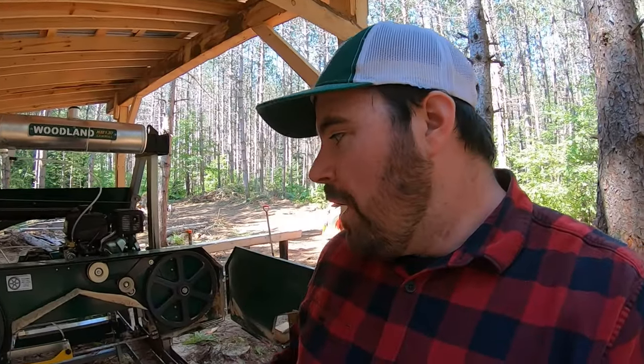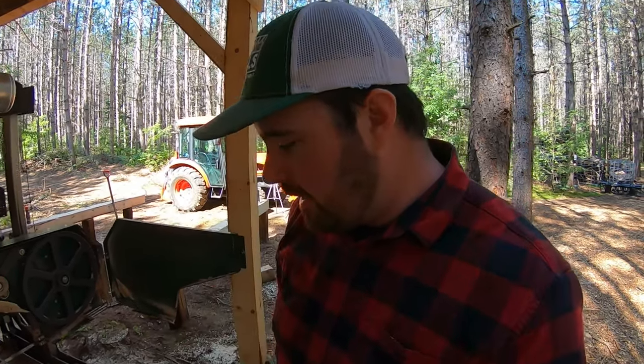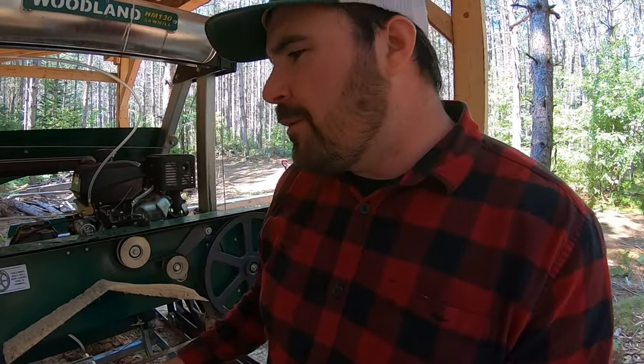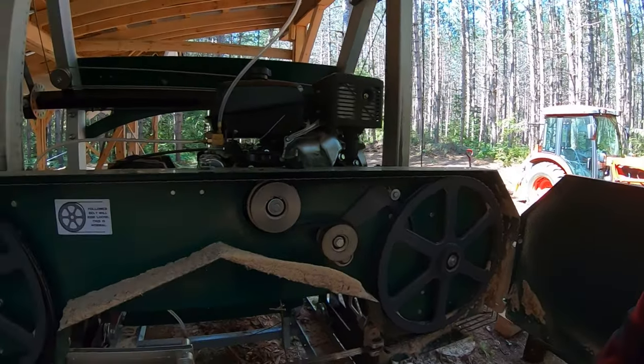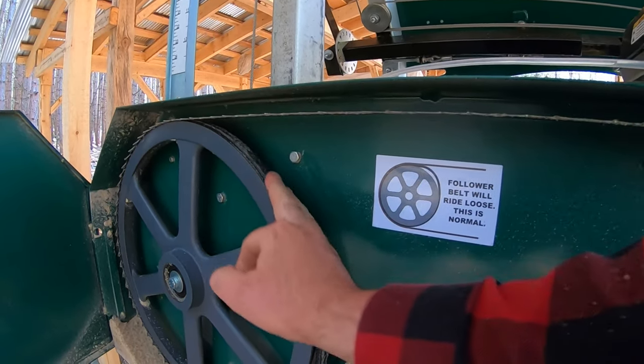Close is probably good enough as long as it's not touching — you're probably going to be good assuming the gap isn't too big either. If you get too big a gap, the one time the blade deflects a little bit and needs that guide to keep it where it should be, if the guide is too far away and the blade can't touch it, that could be another thing that kicks the blade off. Let's assume everything looks good: blade is relatively new, gaps between the top of the blade and guide block are half a millimeter, same on the bottom, and the guide bearing gap at the back is one millimeter. Once the guides are confirmed, look at the belts — there's a belt on the follower band wheel and one on the drive band wheel. Check that the sawdust on it isn't packed solid.